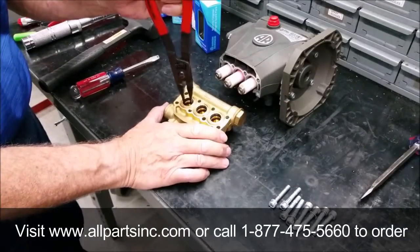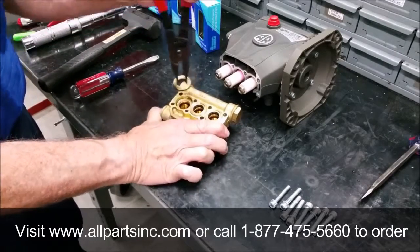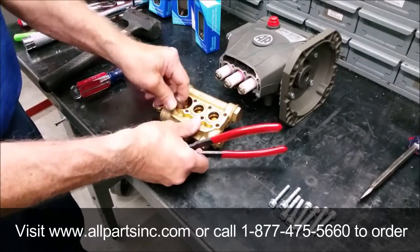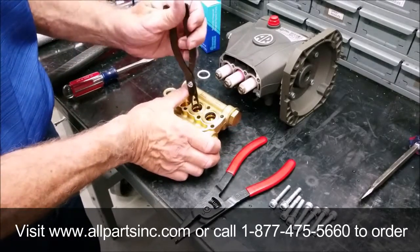Next, remove the rear piston guide using a reversible pliers. Grasp the seal under the piston guide and wiggle side to side while pulling. Here's another type of reversible pliers.